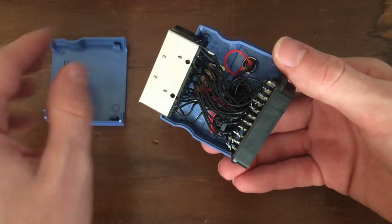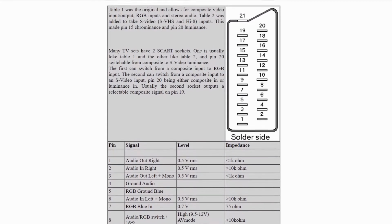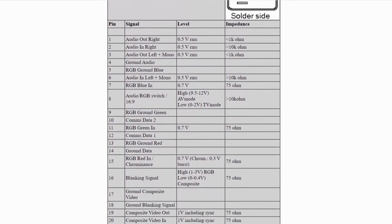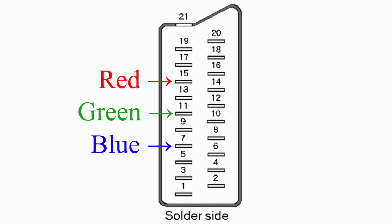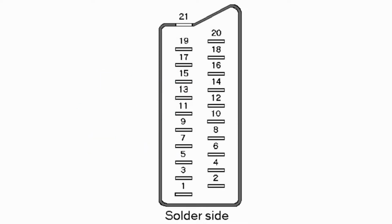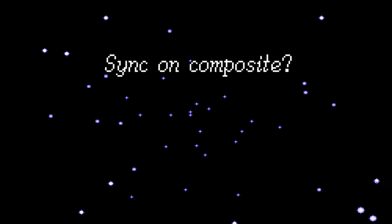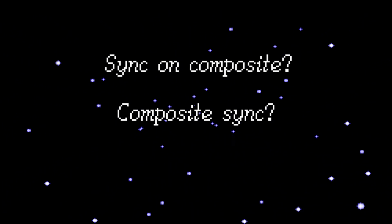Ugh, what a mess. Now, I am far from an expert at these things, so to really understand what I was doing, I took a look at this pinout diagram. I'll have a link to this diagram in the description if you want to take a look at it yourself. It looks like we've got a pin dedicated for red, green, and blue, as well as a specific ground for each of them. And don't forget sync, which we'll be using the composite output for. I believe you would call this sync on composite, unless it's composite sync. I don't know, I'm figuring this out as I go.